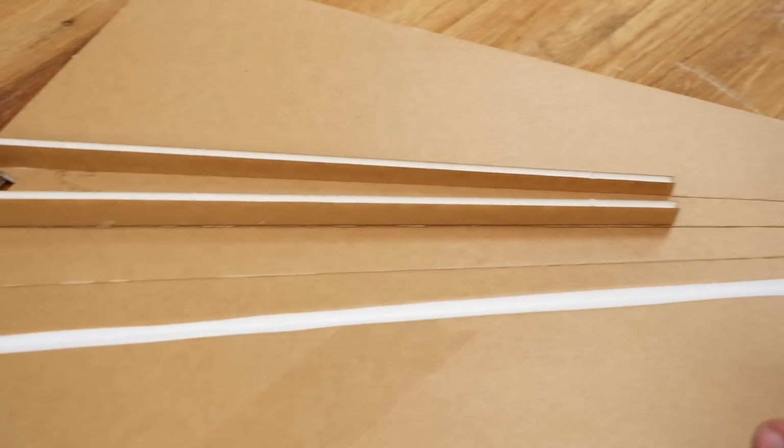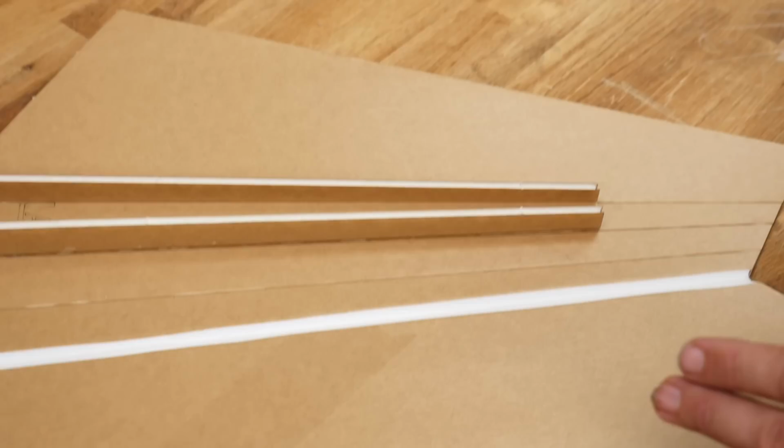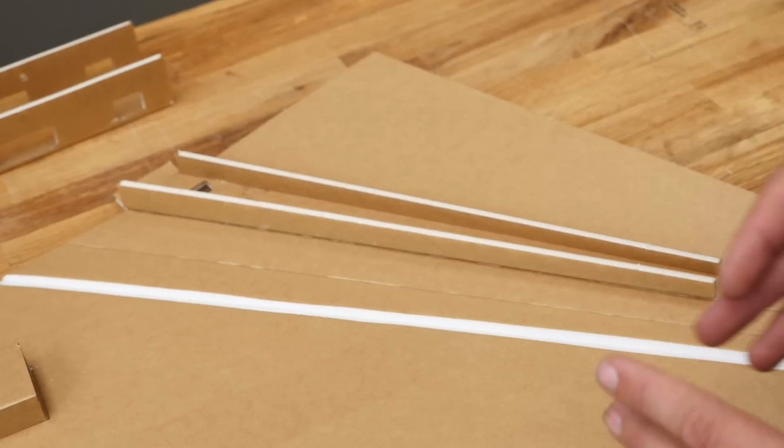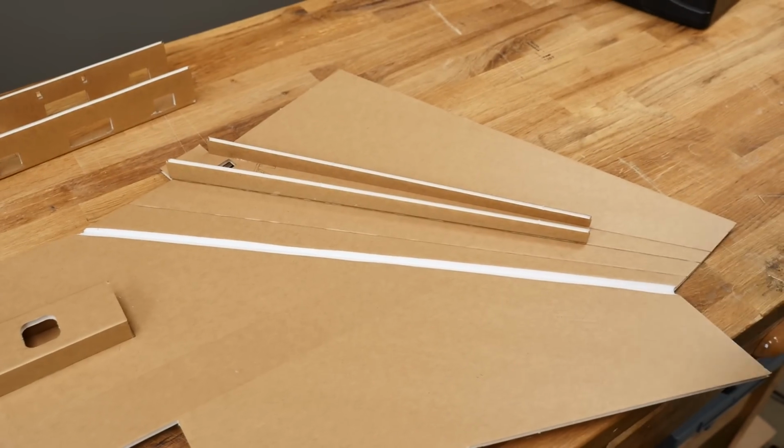We've adjusted our lasers now to give a really nice etch, and also on the instructions, the indicator of cutting halfway through gives a really nice crease. There's no need to open them up even more, and as a matter of fact, it actually makes it a little bit weaker and the airframe doesn't last as long.